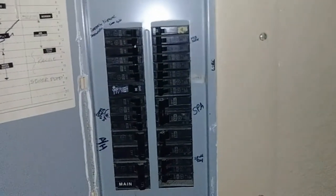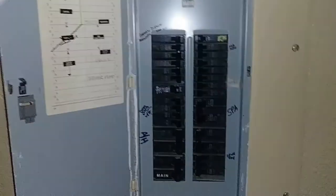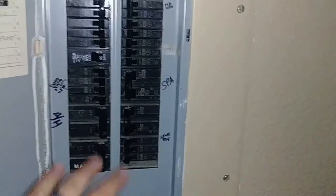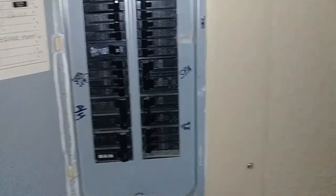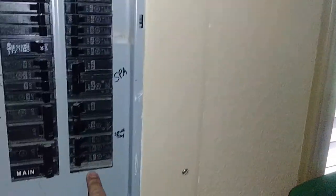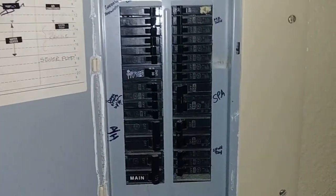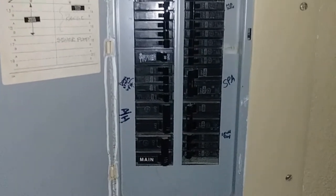I mentioned the electrical panel for your house — the main one. This is my main breaker panel for my house, and as you can see here, I already have a hot tub, and those breakers are right there where it says SPA. If I was adding one to this panel, you can see down here I only have one slot left — one open slot. That could be a problem because you can see how big this breaker is for the hot tub. It's a double 50 amp breaker. So if you're about to add a hot tub, it's a great idea to take a look at your breaker panel and make sure you have the space.